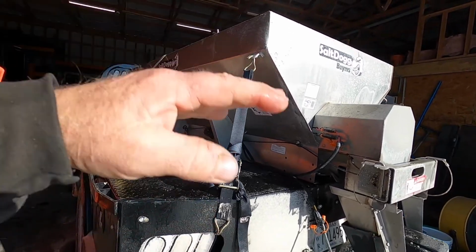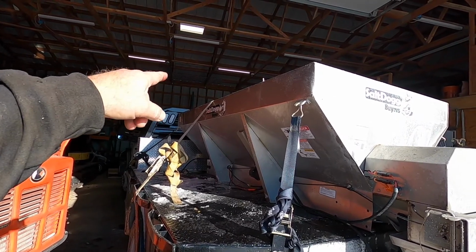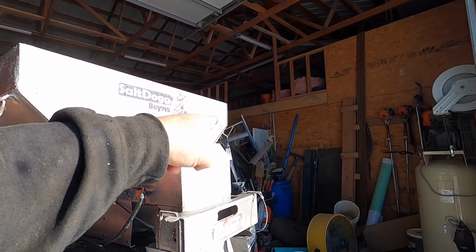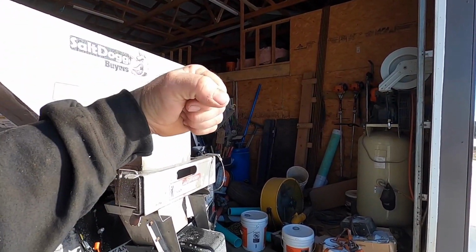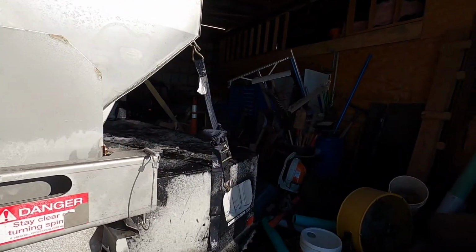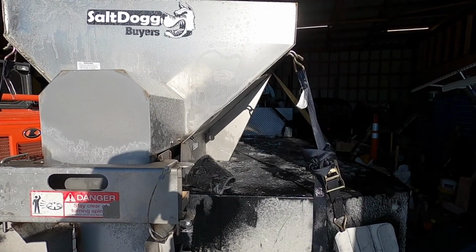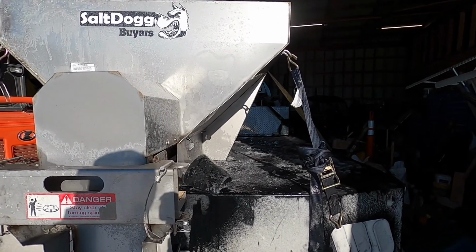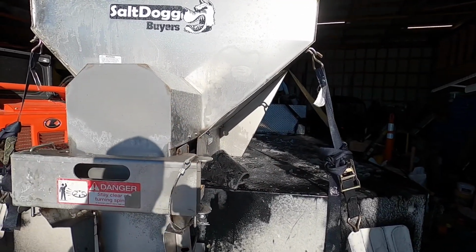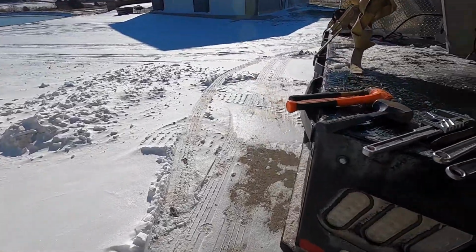Anyways, I'm going to try to set the spreader in front of the blade, and I'm going to strap whichever side I need to strap to the blade, and then I'm going to grab the opposing corner and reach over it with the excavator and kind of pull it and see if I can re-rack it and straighten it. I think that'll probably work. I don't know. But obviously I'd basically pull from the other set of corners. We'll see what happens. All right.